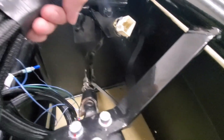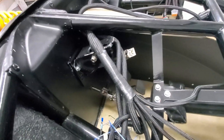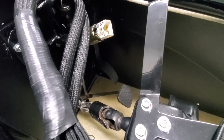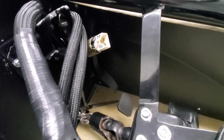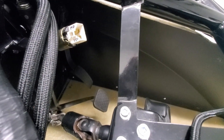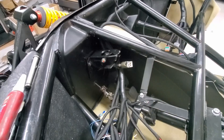Essentially I've got the gas pedal and brake pedal. These bolts are just barely long enough, so I'm going to get some that are a little bit longer. I'll look at the pedal arrangement and see if I like it. On a normal car, the gas pedal is a little more towards the firewall than the brake pedal, but this one seems a little more than I'd like. I may want to get a spacer to go on the bracket for the gas pedal to put it out just a half inch or an inch.